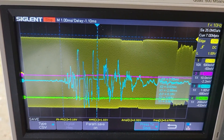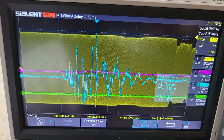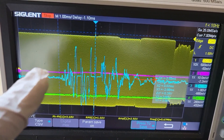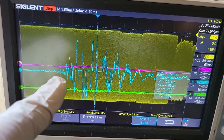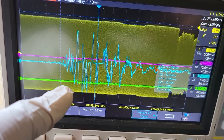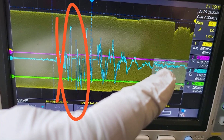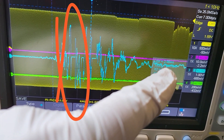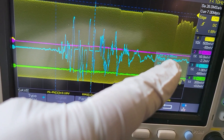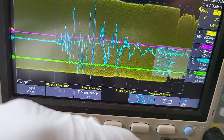This is the third measurement I took. As you can see, it took approximately 2.9 milliseconds from the time the powder ignites to the time the bullet exits the barrel. Again, there's quite a bit of vibration from the blue curve right before the bullet exits the crown, as indicated by the spike in the yellow trace.